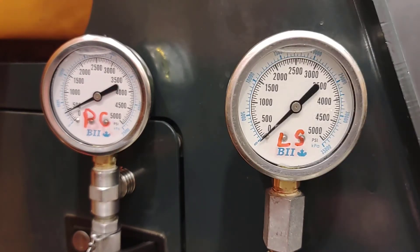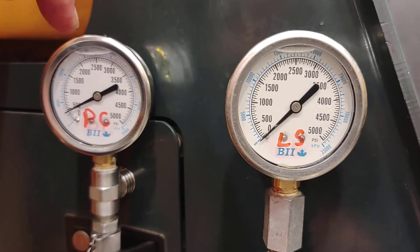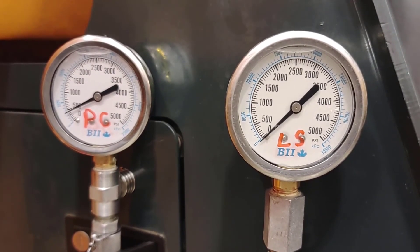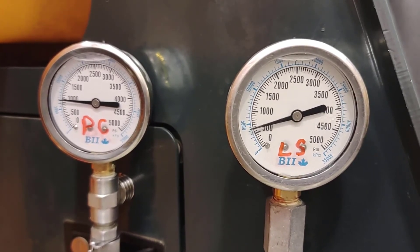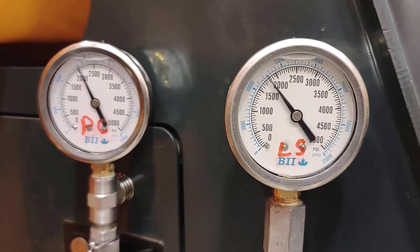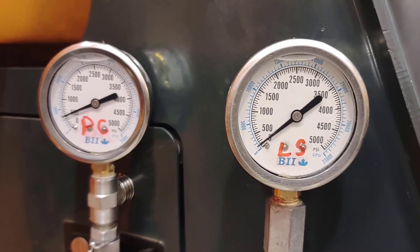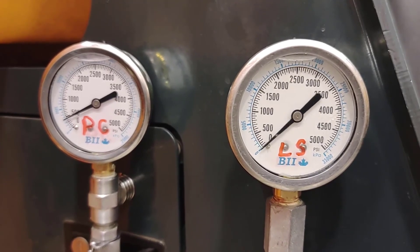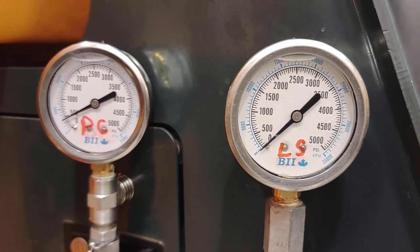Next I'm going to watch the gauges as I actually hit a function. You'll notice that when I hit a function, the load sensor pressure does come up. The PC — which is the pressure compensator spool, my pump cut-out pressure — is going to come up and it's actually going to be a little bit higher than the load sensor. Pump output is always higher than load sensor because the pump is always pushing a little bit of extra pressure, which means it always has sufficient flow for the function. As we increase the load you can see the two rise in unison. As the work port pressure goes away, we're back down to low standby. If we slowly increase the work port pressure we can see the difference between work port and pump output — that's your differential pressure. Every load sensor system operates like this.